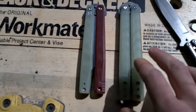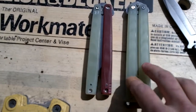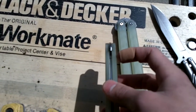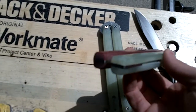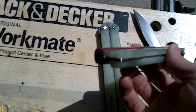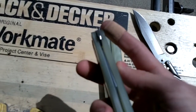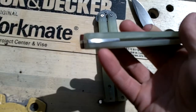First, on the handles, I have been thinning them out a lot more. I've been doing it so that it's more squared off around the pivot area to make it easier for chaplains and twirling, and on the ends I allow it to flare out, be a little bit thicker and rounded, making it easier and more comfortable for fanning. At its thinnest it's half an inch, at its thickest it's 5/8 of an inch.